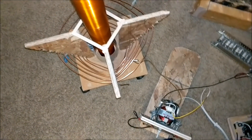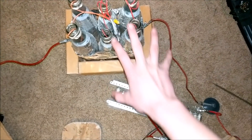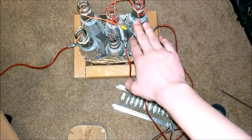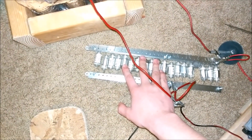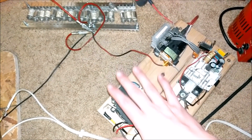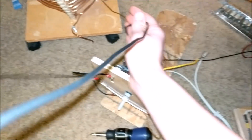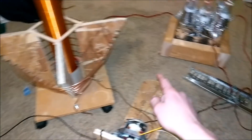Here's the entire setup. We've got our capacitor banks down here, and I have the Leyden jar capacitors which are about 3 nanofarads, in parallel with all these capacitors I got from Russia, which are about 7 nanofarads. So we have about 10 nanofarads in total capacitance. Then we come over here to my ZVS high voltage power supply, connected in parallel to all these capacitors. I then have my rotary spark gap connected to a variac, which is in series with the tesla coil primary coil and the capacitors.